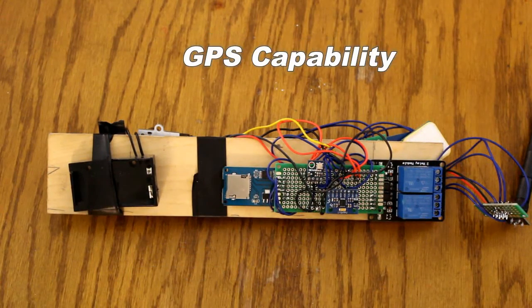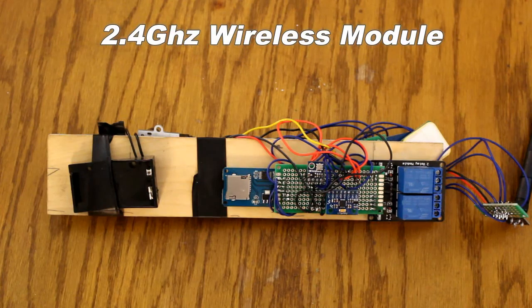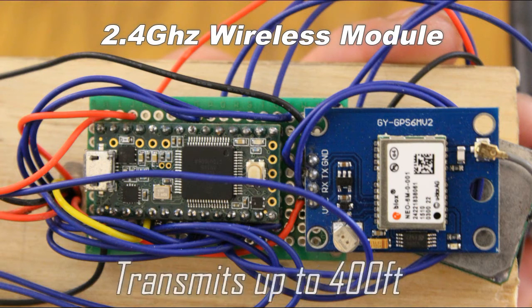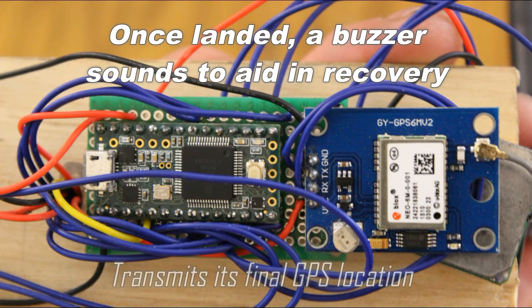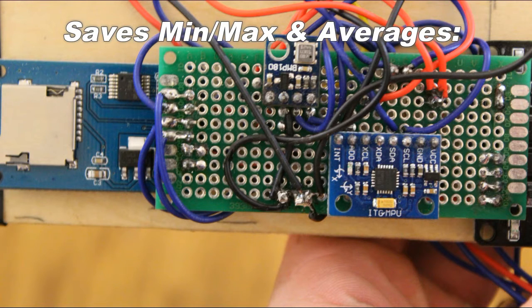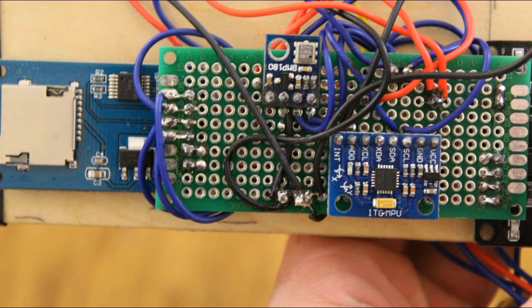It's got a compass that tells me north, east, southwest. It's got GPS capability — it gives speed, time, real-time GPS lock, and coordinates. It's got a wireless card which allows me to transmit information up to 400 feet to a custom-made controller that displays the relevant information. After the rocket touches down, a buzzer sounds, and the rocket will transmit its GPS location back to the launch controller once it comes into range. I can also save the highest altitude reached, the initial altitude, and the minimum and maximum of all the variables, then print them out after the circuitry basically shuts down, sounds the buzzer, and transmits its landing location.